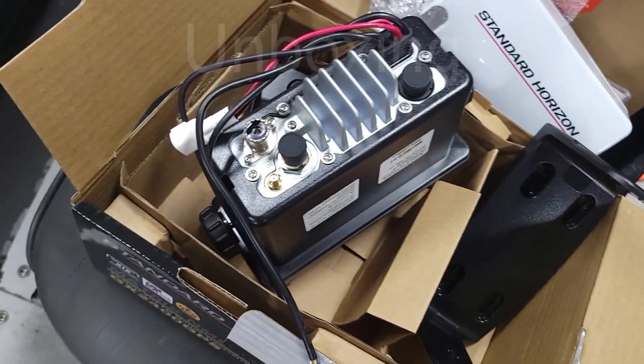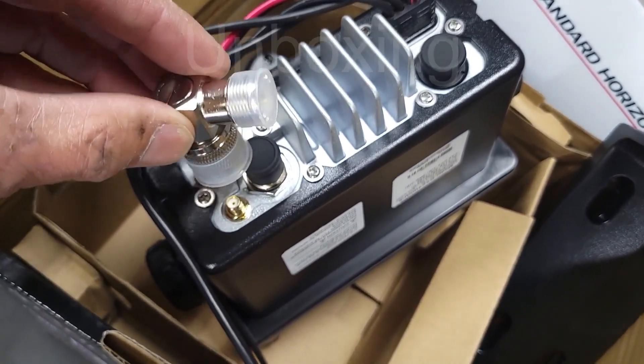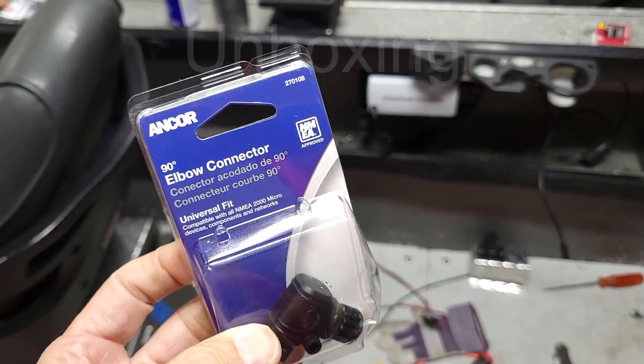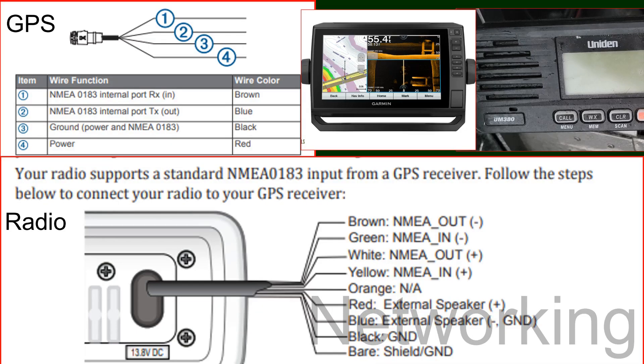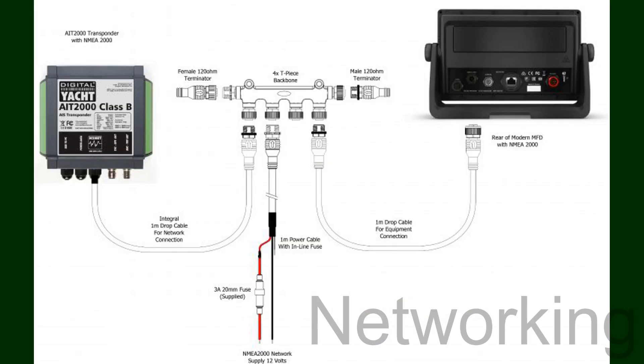For this installation it didn't quite fit, so I bought a 90-degree fitting that'll go on the antenna connection to run the antenna in from the side. And I had to buy a 90 for the network connection too. One of the main benefits of this installation was the simplification of the networking process. On the old radio and the existing GPS, the 0183 networking is a little more complex, and it always shoots you in the foot because the manufacturers use different terminology. The N2K network is much simpler, and you just plug in the devices and it's ready to go.